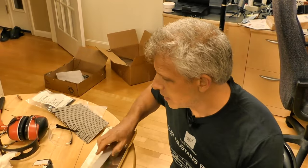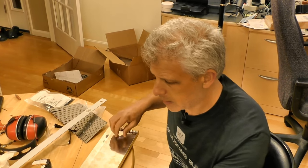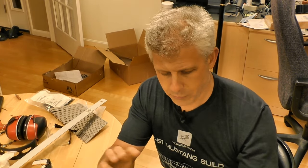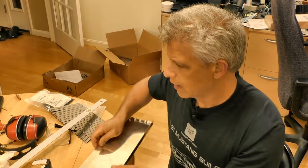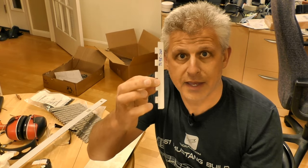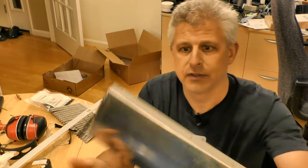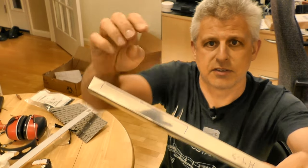All right, so Jake has now already gone and mounted the hinge points, those brackets to the doubler. Those are looking great, and now it's time to do two things. We now need to attach the doubler, and we also need to attach the halves of the hinges that are gonna go on both sides. And so I drew a little basic outline, you can just barely see it, of where the hinge starts and stops. And now I need just to measure out and get these put into place and get our rivets so that we have our hinge doors ready to go.